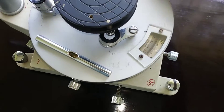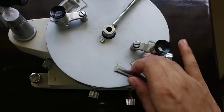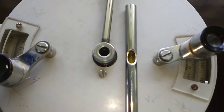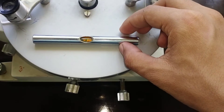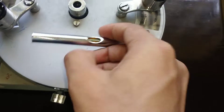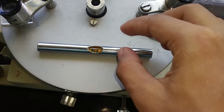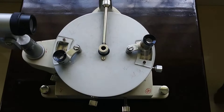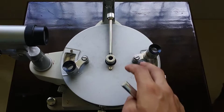Next I am removing the prism table using this knob. Now I will place the spirit level on the top of the base. You can see the bubble is in between the notches in this position, and also in this position. Here a slight adjustment can be made — now the bubble is perfectly in between the notches. We have assured that the base of the prism table is perfectly horizontal, that is, the base is leveled.